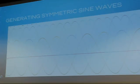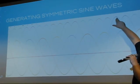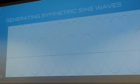And I did that work, and you can see these funny little bumps where one phase temporarily goes up and comes back down, and comes back up and comes down, and then is held at 0. And that's just how you can get a sine wave out. That's basic stuff. Is that clear? You just want the difference between the phases to have that sine relationship, so their absolute voltage doesn't matter.